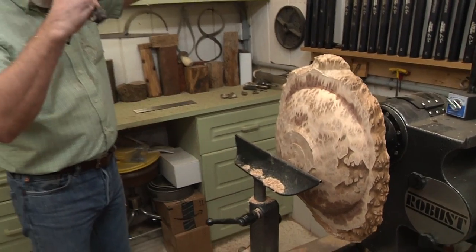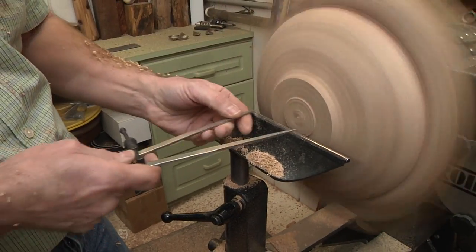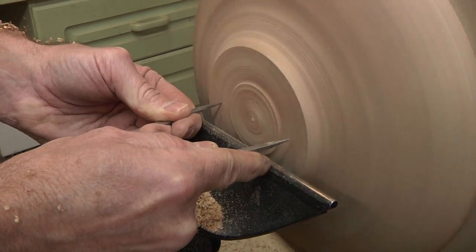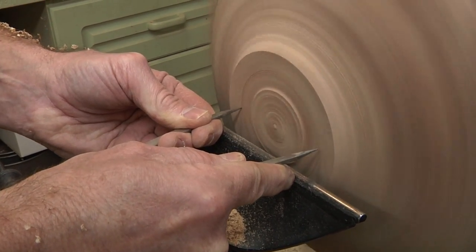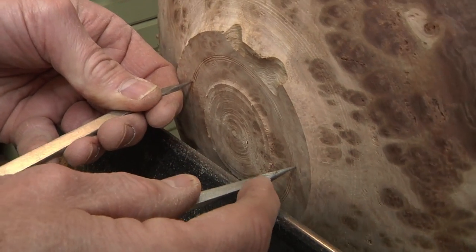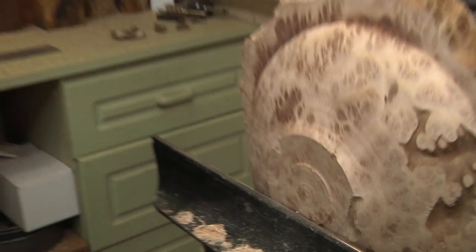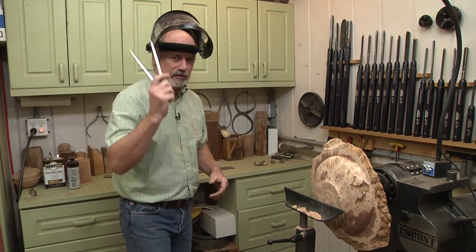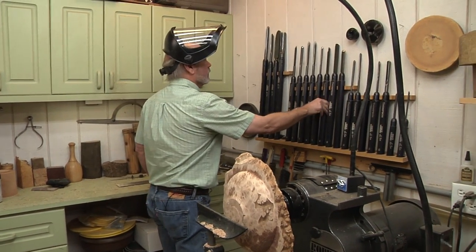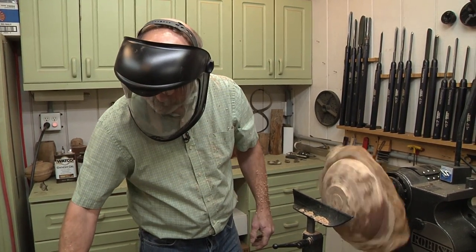I'm going to transfer that mark onto here, then turn this back on. I have a sharp point and a dull point. So I keep the sharp point away and touch this to transfer the mark. Now I'm going to hollow this out — I know how wide to make my tenon, so I'm going to make it a little wider than three inches exactly. I'm going with a smaller bowl gouge now and just remove some wood because I want to go about three-eighths of an inch deep. I want a good hold with this one.